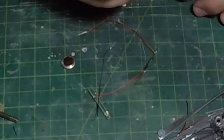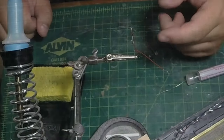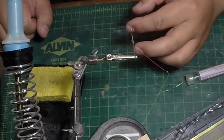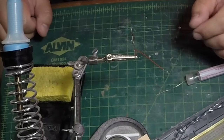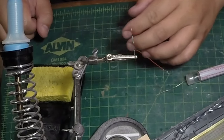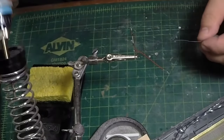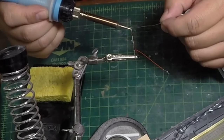This is the most basic of circuits with a switch involved. The nice thing about wire wrapping is that it's solderless, so it's very easy to just wrap and you're done with it. The bad thing about it is it's solderless, so these are kind of loose. Since this is going to be a permanent fixture, I'm just going to go ahead and solder this together.